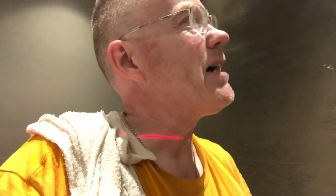Some people might say, oh, the seam's fractured, what can I do? Well, you can just give it an hour after you install it, and then you come back and work it again. You push it back, because there's still liquid under it. It's still movable. It's still workable. We're talking about something less than a 75th of an inch, okay? You know, there's an eighth, there's a 64th, and we're talking about something very minute. So you just keep a little pressure on it, it brings the seam back. You don't want to overlap it, and you certainly don't want to push it up off of the surface. You just want to push it back. You'll see as you work it.